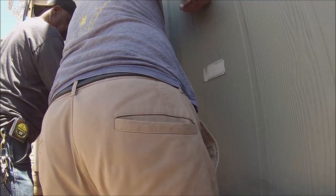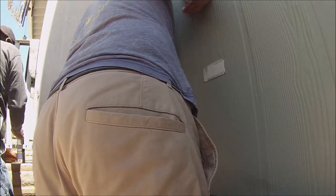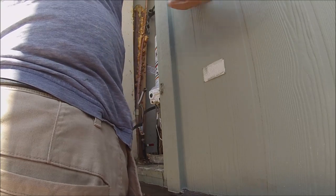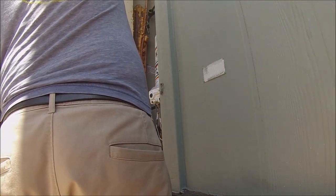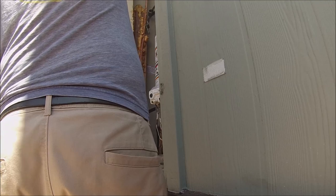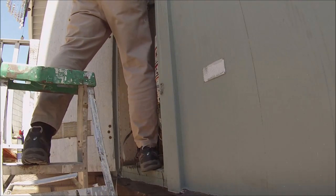Yeah. It's only 16 inches. So you can't get it in? I don't know. The heater's only 16 inches. I've got them in before. I think you can probably get it. Yeah. So go right in. We don't have to mess with that. I'll just cut it and put a SharkBite on that side, so you'll come supply line off. Yeah. Just like we did the other night, and I'll cut that one, and maybe just sweat one on there. Okay. Good. And then you'll just be able to do your supply, and it'll go quicker.